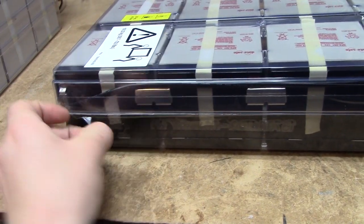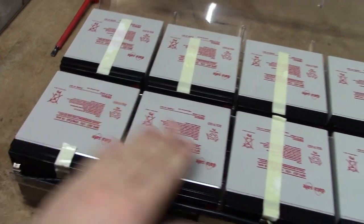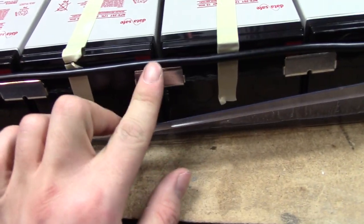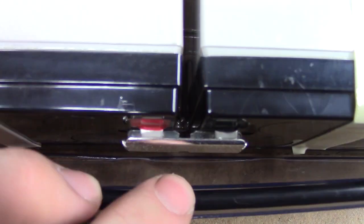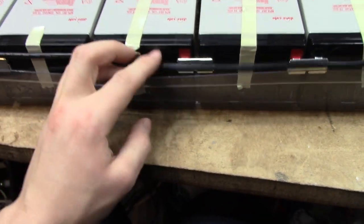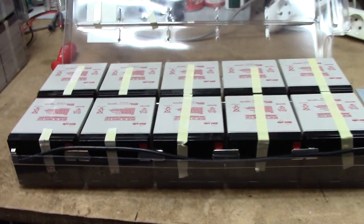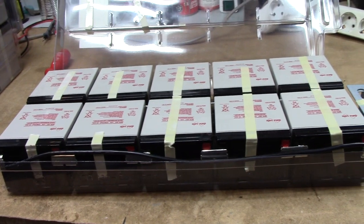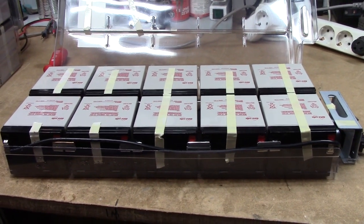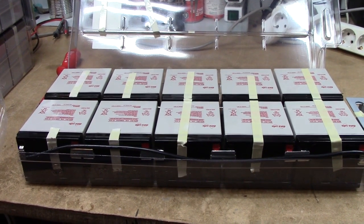The way these battery packs come apart seems to be quite straightforward, because it's just got a single strip of tape. A lot of violent prying later, it seems we're in! Once you get to this stage, it seems to be fully straightforward to service this pack. The batteries seem to be clamped together by a really nice metal insert. I like the look of that - really quick to assemble, as long as it's not soldered. Please tell me it's not soldered. No, it's not soldered. So I've just got to unclamp those and I can disassemble the pack. I'm probably going to try to charge these batteries one at a time. A lot of them are just going to be dead short or have negative voltage across them.